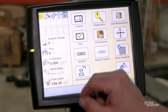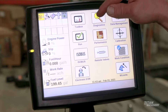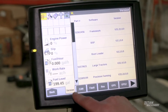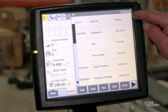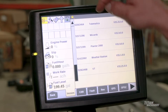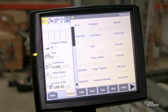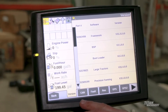Pushing back will get us to our diagnostic screen to check our versions of software that is on our display. The very first tab is the versions, and we want to look at each one of these and make sure they are all up to version 31. If you don't know what the latest version is, you want to contact your local dealer and find out what version you need on your display.